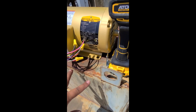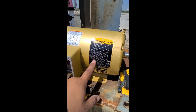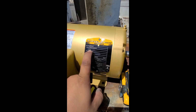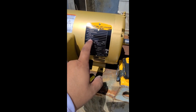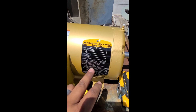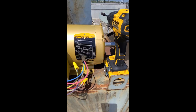The frame number matters — that's the bolt placement and the length between bolts, the positioning. So they're going to want your frame number. Efficiency matters too. Really your key specs are: model number, voltage, horsepower, RPMs, and frame. You can alter the frame if you're good with nuts and bolts, drilling holes, and fabrication, but to save yourself time you want to match those — frame, RPM, voltage, horsepower, and the amps.